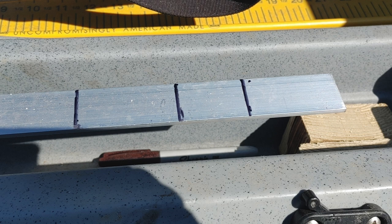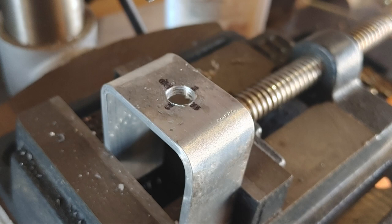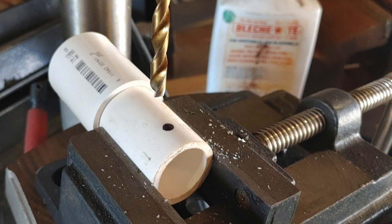Originally I had bought the perspective mount for the Garmin LiveScope, but good grief, that was $100. So I took it back because I saw a video on YouTube of someone that made one just out of one-inch-wide by eighth-inch-thick aluminum. So I've got it marked off here — I'll cut it and then bend it into a U-shape, and it really works slick. Here I've got it cut and bent, with the X marked where I'm drilling the hole in the bottom to mount the transducer to this aluminum bracket. The hole is drilled and that's the shoulder bolt that will hold the transducer in place. This unit is going to be portable — I have a short shaft on the kayak.